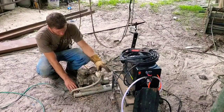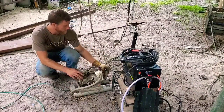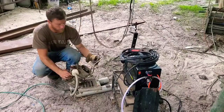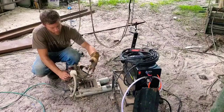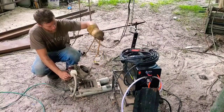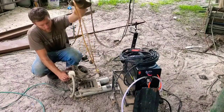It's got two chambers that compress air, and it's got a big electric motor on the inside here. And then it's got cooling fans on either side. Basically all I did is I took the compressor part out of the machine, disconnected all the other stuff, and I took the output right here — this is where the air output is — and I hooked up these two small tanks that were inside the machine. I hooked that up, and right now it has no shutoff on it. You power it up. This is the capacitor that was inside in order to make it run — I just wired the capacitor like this, and then put a power cord on it directly. So you just plug it in, and it powers up right away.